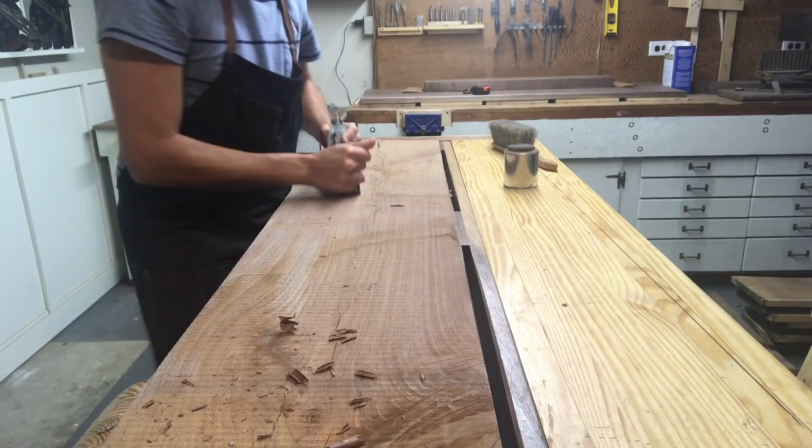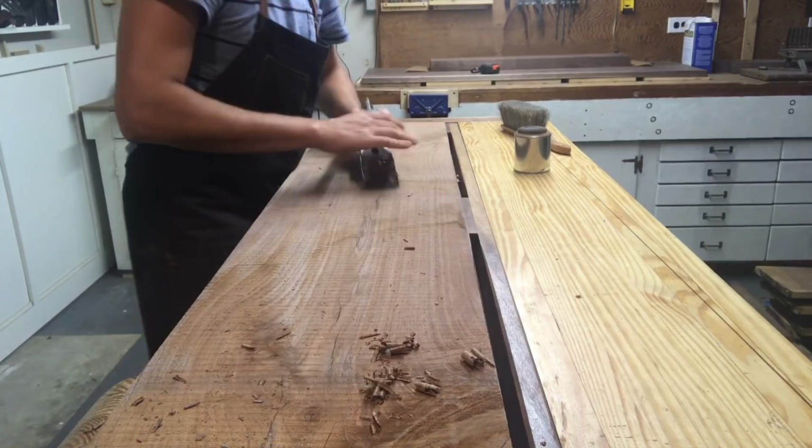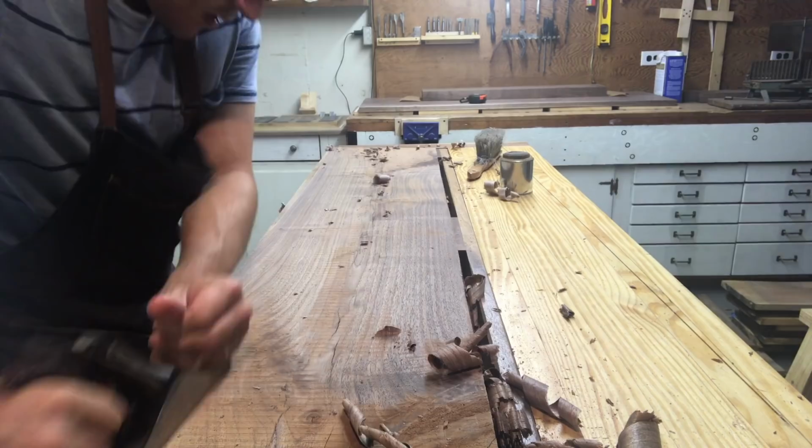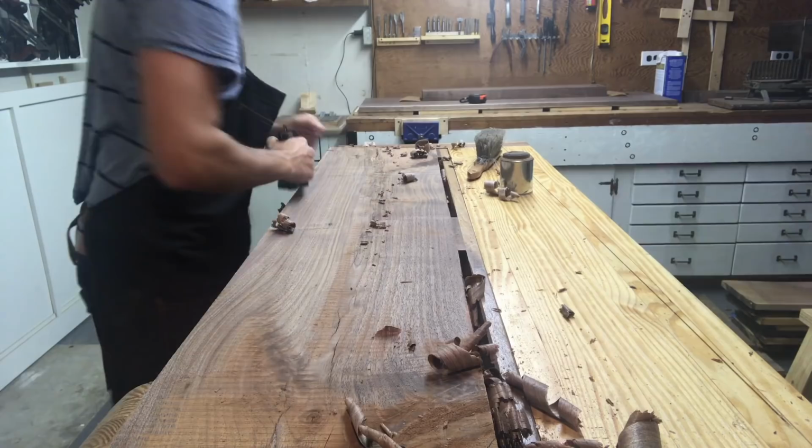And it begins right here, just by giving a quick, you might call it a skip planing, or just a once over with the scrub plane. It doesn't matter, I just want to see what the grain is, and if it's doing anything weird or anything really cool. And so, however I have to do that, going with or against or across the grain, I just use my scrub plane, and I don't even worry about getting it flat,